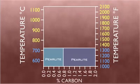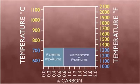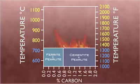Pure iron with a carbon percentage of 0.8 or less has the structure of ferrite, which gives the steel its magnetic properties. Iron carbide exists when the carbon percentage is 0.8 or more and exhibits cementite. It is a hard, brittle material and is essentially a ceramic in its pure form. Although this combination of pearlite makes for a good final product, it is not soft or workable enough to shape the steel into the knife. The steel and its atoms will need to be manipulated further.